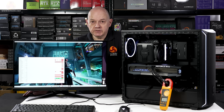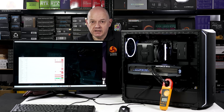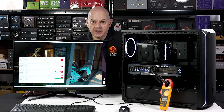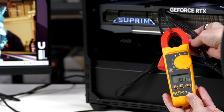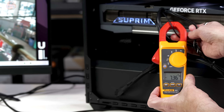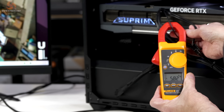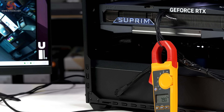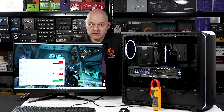Let's see what each of them is doing. What we'd expect is 47 or 48 amps divided by six, which is about 8 amps per wire. And indeed all six fall in a range of seven to eight amps, so that's reasonably well balanced. There's nothing to worry about and it's all looking good.